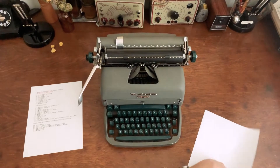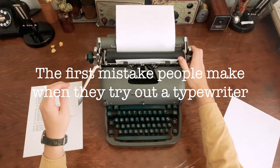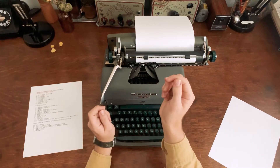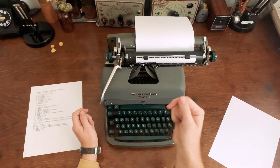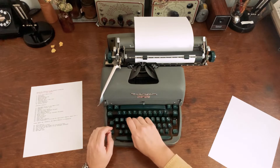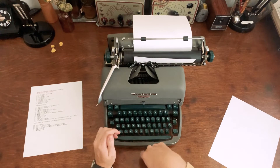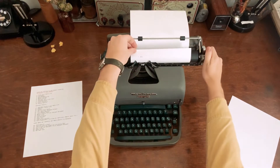I'll do a little demonstration and explain the first mistake people make when they try out a typewriter: they don't use the right kind of pressure on the keys. This typewriter is particularly picky about what type of pressure you use. What you want to do is peck. Peck the keys firmly, but it has to be a peck. You don't press the key hard — you end up with really faint type, it skips spaces, and it doesn't work. You want to peck, and then you get nice dark type.